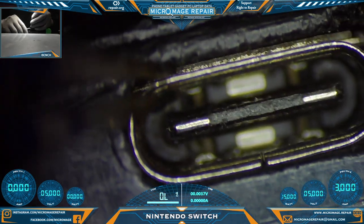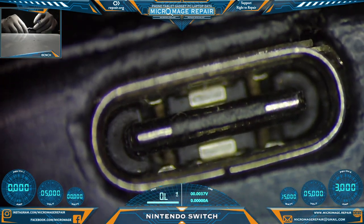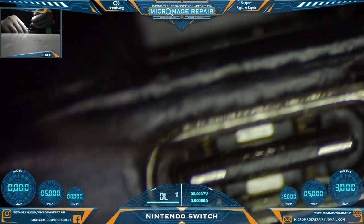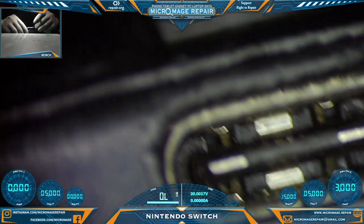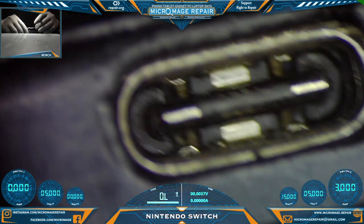Pretty much what we're going to have to do is disassemble, take off this port, and then do our testing. I don't think we can trust anything with the port on. The center plastic in this could be compromised. These pins in the center could be touching. So let's just take it off, disassemble it entirely, and test from there.